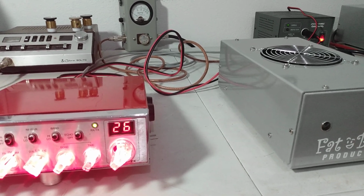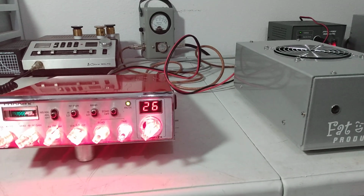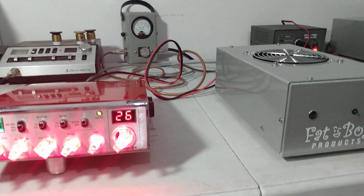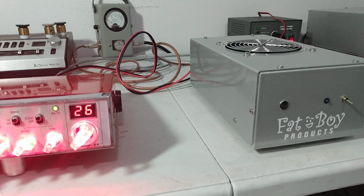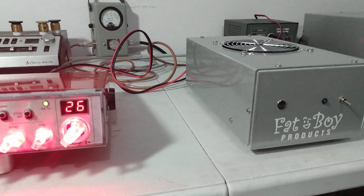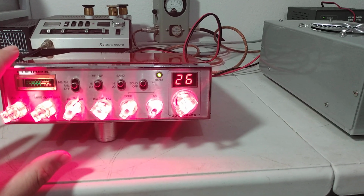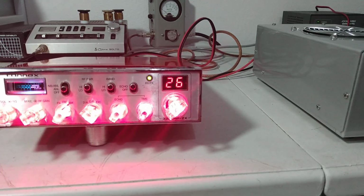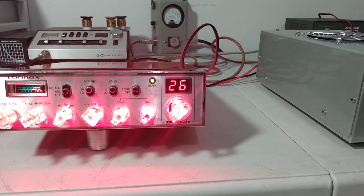Going to try a couple different methods on this thing because the radio that they're going to be using, I think they're going to be running about an 8 or 10 watt dead key and swinging 40 or 50 watts, which isn't going to be enough to push this thing to full output power as far as the peak forward swing. They'll probably get a decent carrier out of it, but the reason I'm going to have to do a couple different tests is my Connex swings about 50 PEP, 15 to 20 watts average, but it does not key 8 or 10 watts. Now, my Uniden, I can roll it up to 7 or 8, but it won't swing what the Connex does.